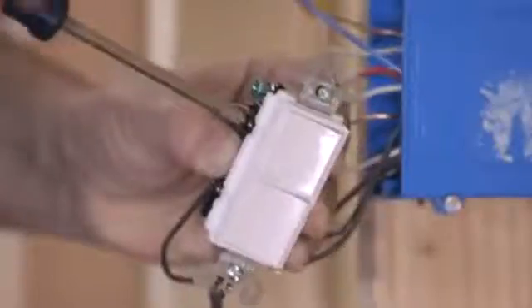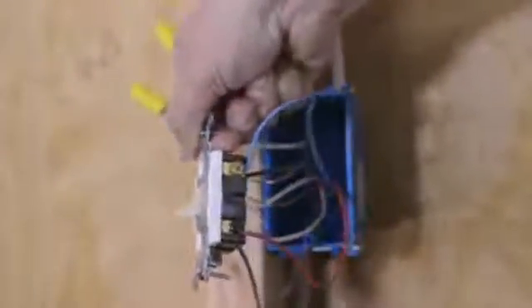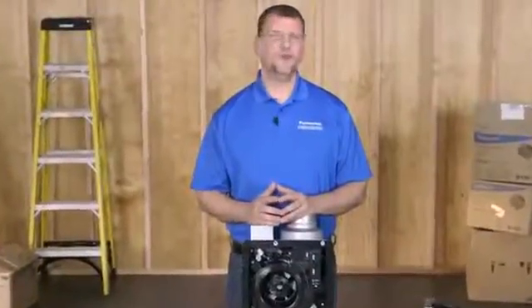If you would like to use one switch to have the light come on when you turn the fan on or to its boost mode, you can use a double pole single throw switch. Use one pole to control power to the light kit and use the other pole to connect the wires for the signal loop to the fan motor. Using this method, when the switch is turned on, the light will turn on and the fan will either turn on or move to its boost mode. When the switch is turned off, the light will turn off, but the fan will continue to operate at full speed until the delay timer times out.